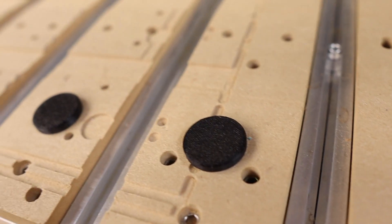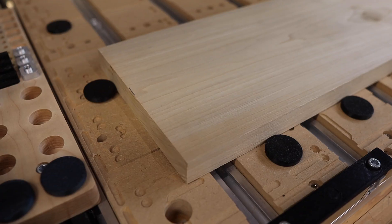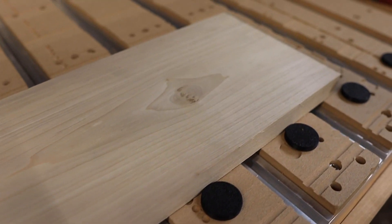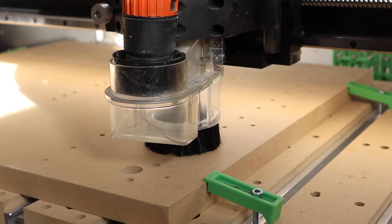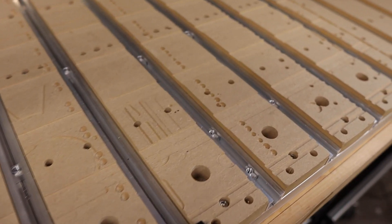Additionally, I added 20mm dog holes on the X and Y axis to act as a fence system. This gives me a stopping point to use my sideways pressure clamps I talked about earlier, or a really fast and easy point to reference material, so I don't need to constantly re-zero my X and Y axis zero points. And by holding these dogs about an inch or so off the bottom portion of the wasteboard, I'm still able to apply downward clamping force to the bottom of my workpieces, which is really important if you're dealing with slightly bowed material. My wasteboard upgrade is made with 1-inch thick ultralight MDF, so you're able to get more resurfaces out of them over the stock 3-quarter inch wasteboard. I've had this set on my Shapeoko 5 Pro for about a year, and I couldn't go without them now.